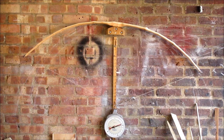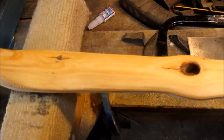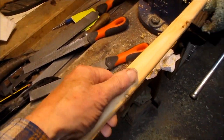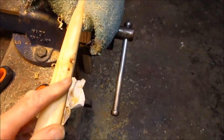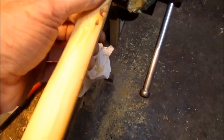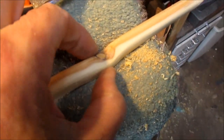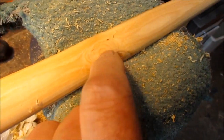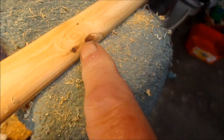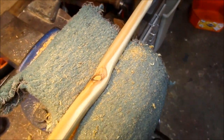45 at 25 — she's pretty highly stressed. Looking at it closely and remembering the lower limb has a bit of reflex, you'd expect the lower limb to look quite a bit stiffer. So I'm going over the right limb, tidying up areas that are potential stress concentrations, cleaning out tool marks, rounding the edges. Areas like this where we had a filled knot — that's virtually all gone now — you can see the wood's quite a bit thicker there and there are these little ring islands showing. I could probably take them down until they disappear, just to ease it off a tad.